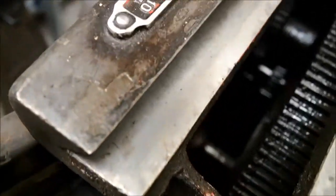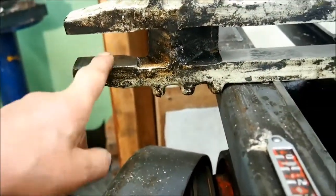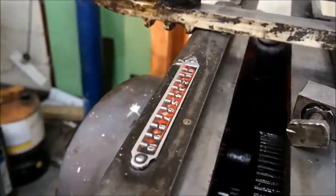The biggest issue is this area here — this fork runs on a pin down inside the bowels of the machine. You probably can't see it, but I can see it in the camera: it's that shiny pin running left to right below the gear. That pin is pressed into the body of the machine so it's not easily removable, and it runs inside this fork here. There's a fair amount of wear — I've done a measurement with a micrometer as best I can. That pin is worn on the sides but not the top and bottom because it doesn't rotate.